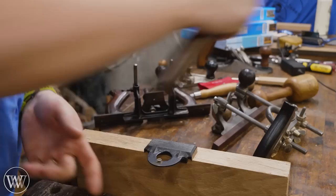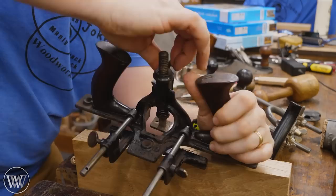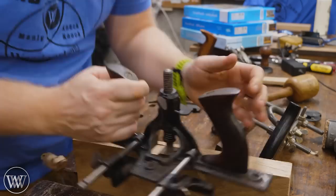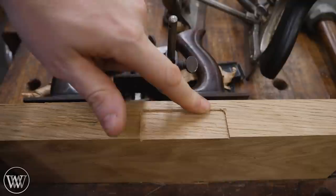Then I can set the cutter in here, go down a little bit deeper, loosen up this nut, run it a quarter round the other direction, let it pop down. Now we can tighten it all back up and go a little deeper. Once we finish in that direction, we can loosen it, pop the lever, rotate this all around again, have all the exact same settings and come back at it the other way. After two to three passes, you're left with a really nice clean mortise with either a sharp corner or a rounded corner that your hinge will fit into perfectly.